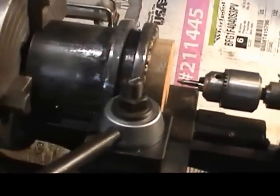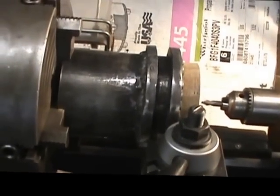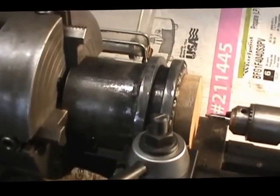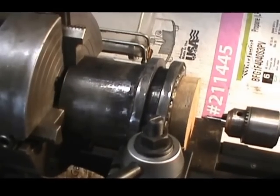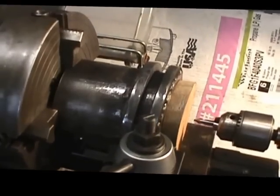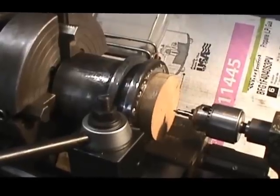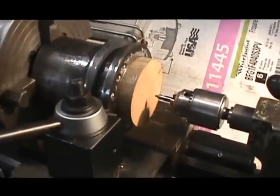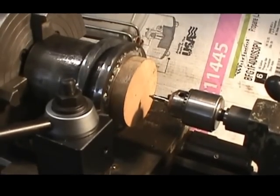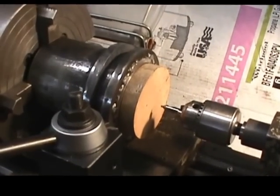As you can see here in the chuck, we've only got a small area that the chuck is actually grabbing on. With the machining being done out on that outboard end, there's a risk of the part coming loose in the chuck and binding all up and causing lots of problems. So I'm going to go ahead now and start machining that center, and then change out the chuck to a live center and install that, and the part will be nice and stabilized. We'll catch you in a few minutes and show you a little bit more.